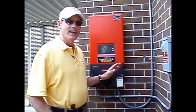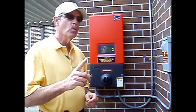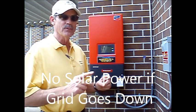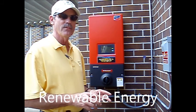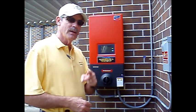The other side of this inverter is connected to the electric breaker panel. A few things of interest: Number one, this kind of PV system does not produce power if the grid is down. Number two, its main purpose is to offset your utility bill with clean, efficient solar power. Every watt produced by this system is fed into your breaker panel — it's either used by your appliances or fed back into the grid. Yes, your meter can run backwards, but it'll take a lot larger system than a 3KW system to offset your entire electric bill.